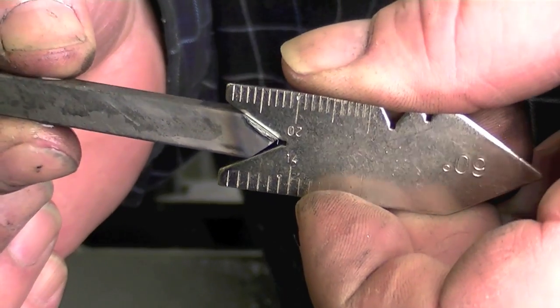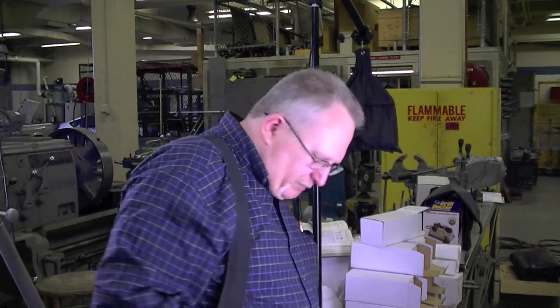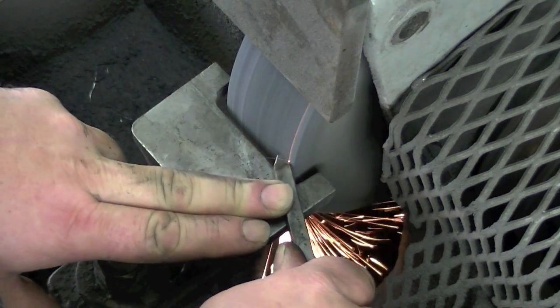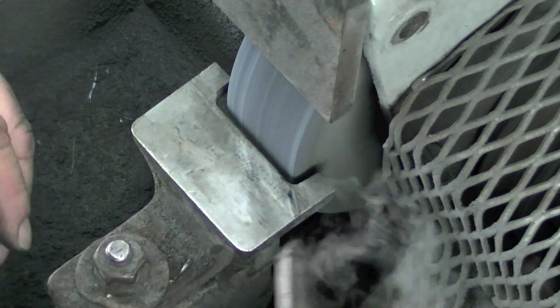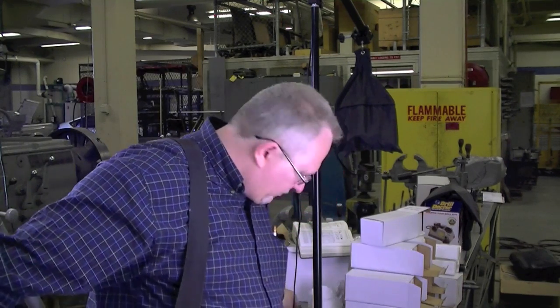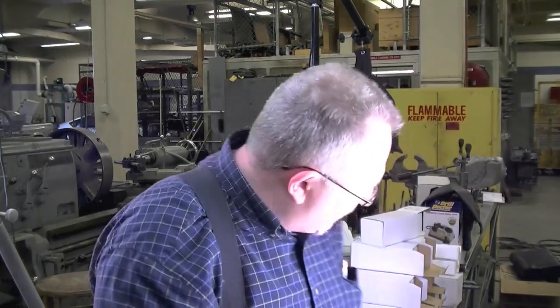Let me take a look here. Looks like we've got way too much — it's too blocky. So I'm going to find out where I was and then crank it over some more to make it actually sharper. Let it cool down. Let's check it. Looks like there's a little too sharp — it's got some slop in there. So I'm going to have to grind the tip away.